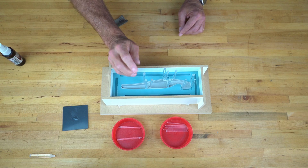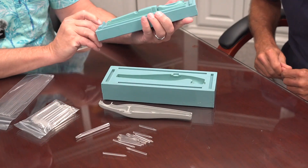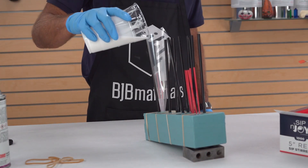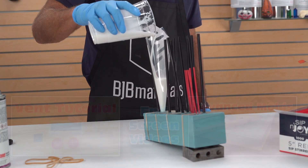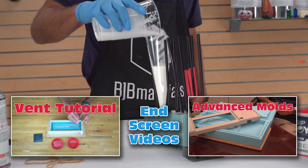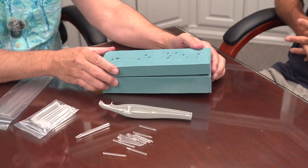You've got one, two, three vents. And where's your pour spout? Right here — on this one I just angle it straight up like that. And that's something from a lifetime ago — I worked in a shop where we did molds similar to this, and we would always have a slight rakish tilt there to allow that air to travel out.